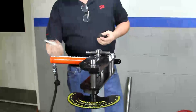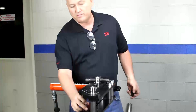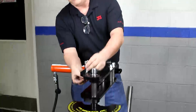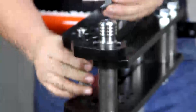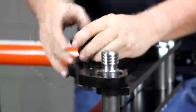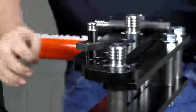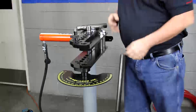To install this, it couldn't be simpler. Just match it up with the holes in the die — that die happens to have four-inch pin centers. We're going to pop it up, take this piece right here — it's kind of keyed so it's hard to mess it up. You put it in, drop this on there, open up the set screw a little bit so she'll go down. We're going to get it up a little bit higher than we need it and just let it sit there. Now let's go ahead and put the die in the bender.